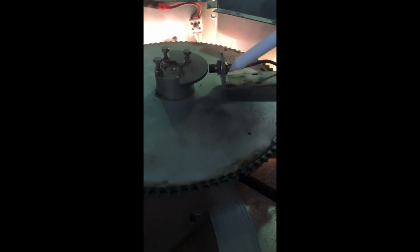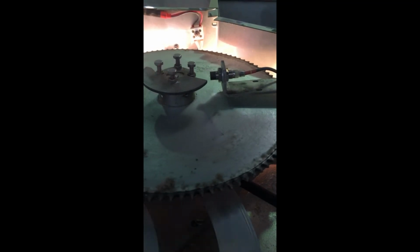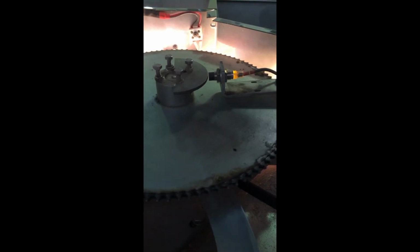A rotation fault is instigated by this proximity failing to see this cam. This is the only way the fault can come up on the screen. There are a number of issues that can cause this to stop rotating. These are the ones on the top drive unit.